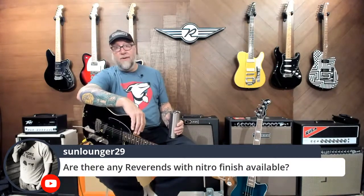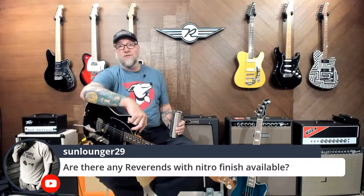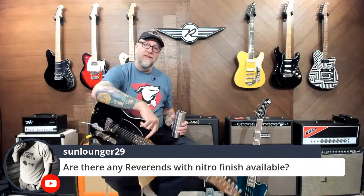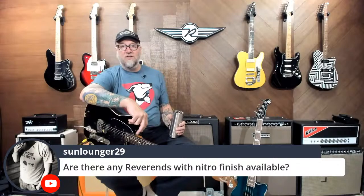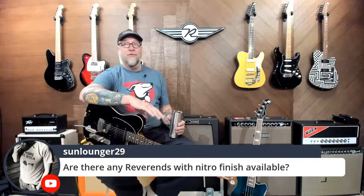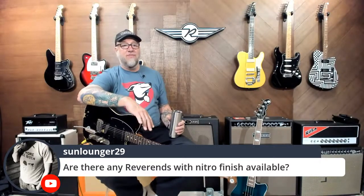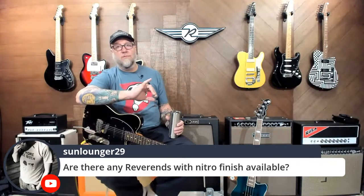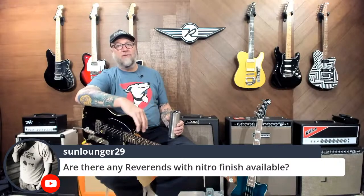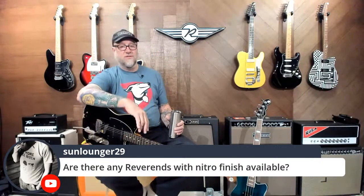We open ourselves up to tiny finish flaws by applying the paint so thin, but we apply it so thin so we're not burying the sound of the wood, the natural tone of the guitar, underneath many, many mils of finish. Often when you hold the guitars up to the light, you will actually see the wood grain through even a black or an opaque finish because the finish is so thin. And that is what I believe is the important tone difference between a nitro and a poly finish. We have addressed that with the poly finish, and having a finish that's more durable at the same time.